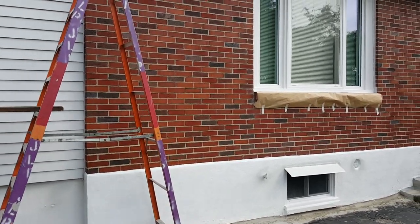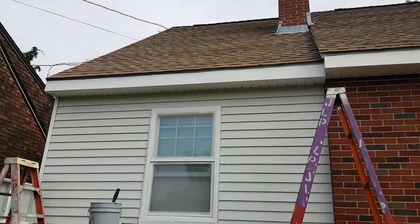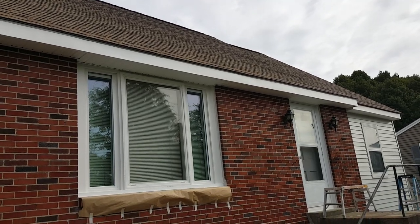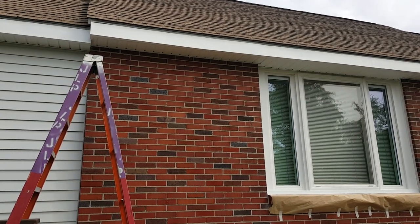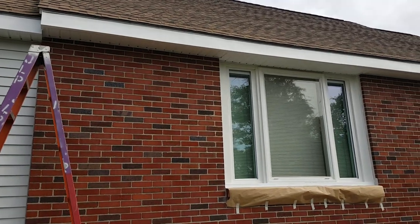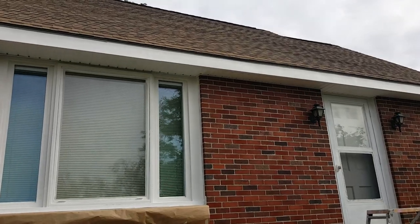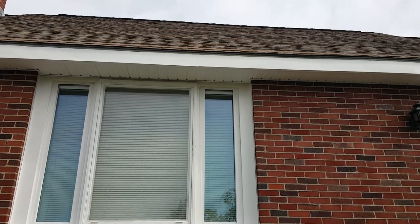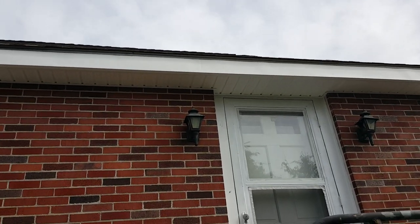And this time, what we're going to talk about is this aluminum fascia board, as you see, going along the top of the side of this house, where it meets the roof. As you all well know, this is smooth, you can't really brush it. Otherwise, at some point you're going to have to stop and then continue where you were brushing. And in the meantime, since you're doing it in the sun or semi-sun here, that's going to start drying. And then once you start painting up to it, you're going to start dragging that paint across and it's going to look terrible.